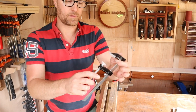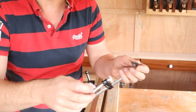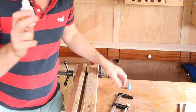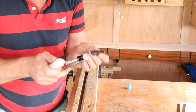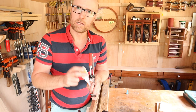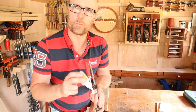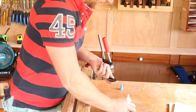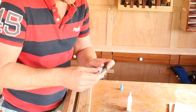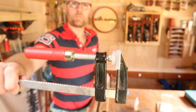My recommendation doesn't stop there. These clamps are notorious for losing the rubber bits and then you end up marring your work. Next step: grab yourself some super glue — CA glue as they like to call it. Pop a couple of dabs on it and that's going to stop you from losing your rubber bits. If you haven't got super glue, epoxy will do the same job. Pop the rubber back onto it, do the same for the bottom one, push it all the way to the top, tighten it up, leave that to dry for a few minutes.